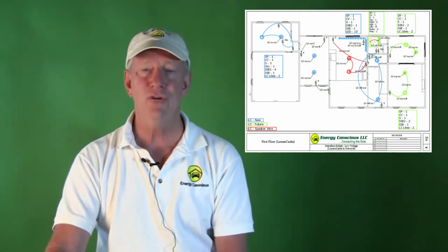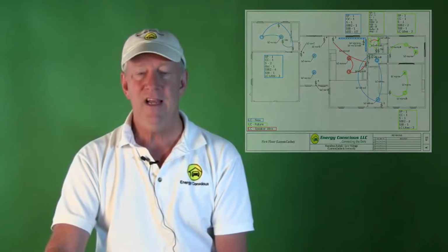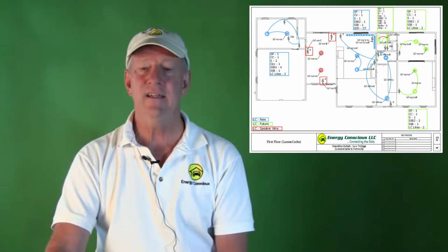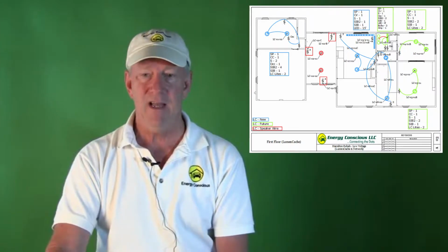Recall from our last video where we discussed cabling topologies, daisy chain versus the home run. In our case, the majority of our circuits were daisy chain since it was cheaper. Recall that the kitchen was a daisy chain flow. Light 2 to light 1 to switch 2 to switch 1. The only exception in our emergency lighting system was the family room. We needed a 4-way light switch, and we had old overstuffed metal boxes.